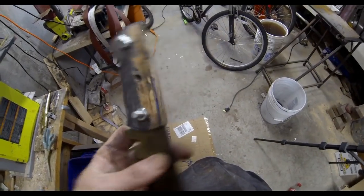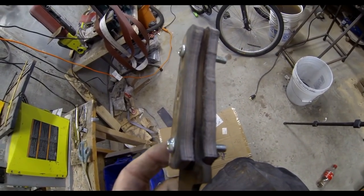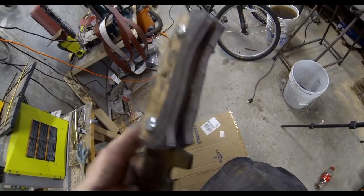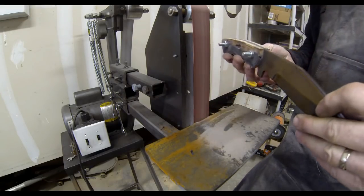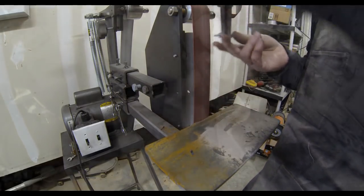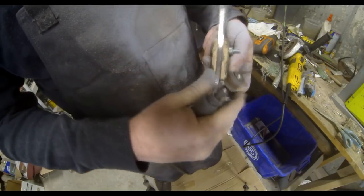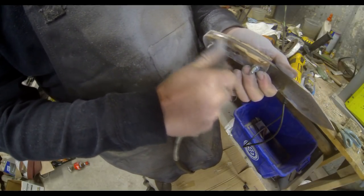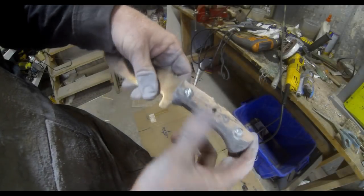These are those hybrid micarta handles or scales roughly mounted onto the blade. This blade has already been heat treated and tempered — that is covered on a separate video. My plan was to mount these scales to the blade just with some quarter inch bolts and really finish off the scales — all of the grinding and forming on the scales — before I had the glass bead finish applied. This way I could just basically glue and pin the scales onto the blade without having to file or sand the blade at all, or ruin that glass bead finish.